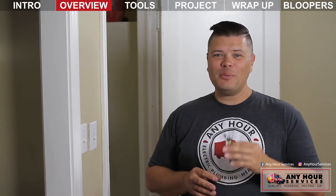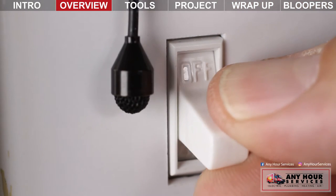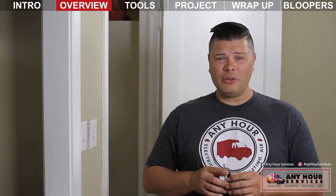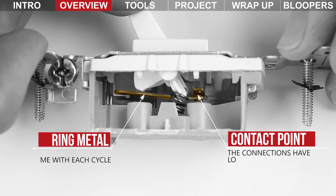The reason that we're replacing it is because I heard some cracking and popping the other day when I turned the switch on. You want to listen for these kinds of noises coming from your switches, outlets, and lights — they shouldn't be making those noises. Those noises mean that the connections inside aren't as tight as they once were. This happens over time with normal wear and tear; it's nothing to freak out about. You just want to replace those sooner than later.